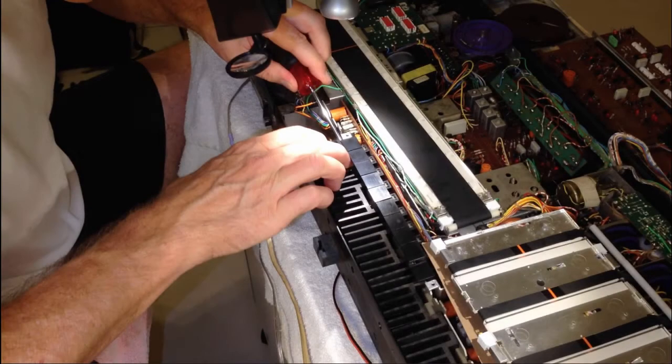Here you see how I took out the second heat sink with the NPN Darlington. I should also mention that I fried one of the back channels, while I showed the circuit diagram of one of the front channels — so this here is the right back channel. Here I jam the screwdriver under the plastic insulator from the side and pull out this heat sink. Since the first one is already gone, you can pull it a little bit to the side to avoid putting too much stress on these switches.